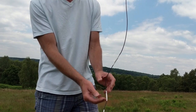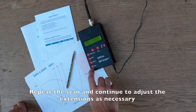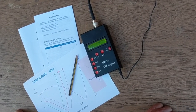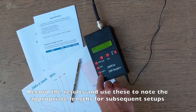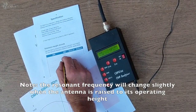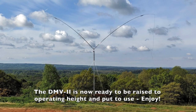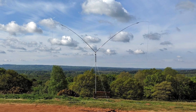And repeat on the other side. I'm then going to repeat the scan in the 80-metre band, and now I can see that the resonant frequency for the lowest SWR has come down to 3.63 MHz, which is where I would like it to be, so I'm going to stick at that. Obviously you can add more or take away extensions until you get to the right frequency for operation. Note that the resonant frequency will change slightly when the antenna is raised to its operating height, and you can allow for this with a bit of experience. The ANV2 is now ready to be raised to its operating height and put to use. Many contacts await — thank you for watching.